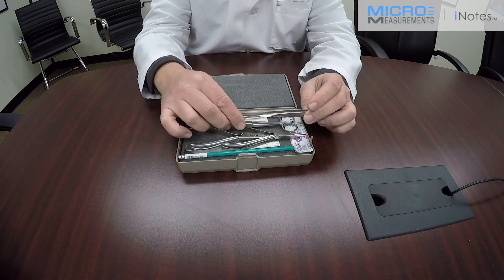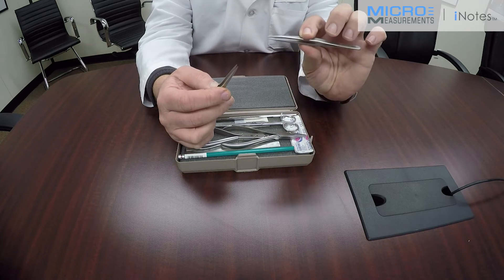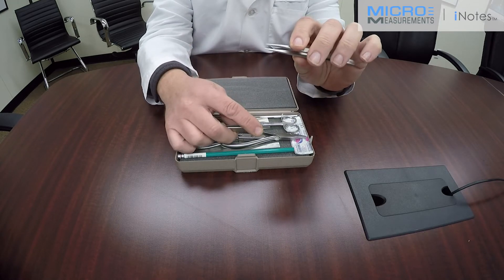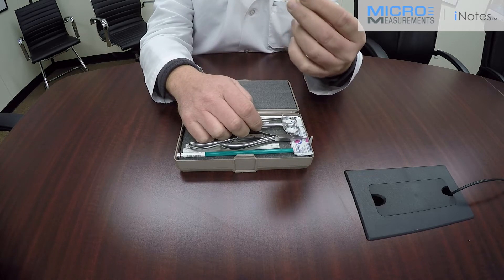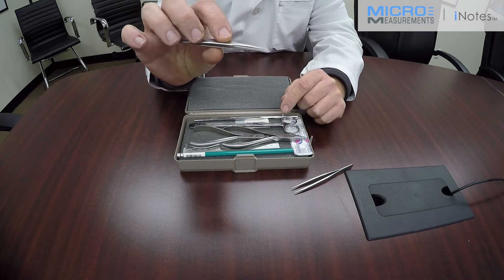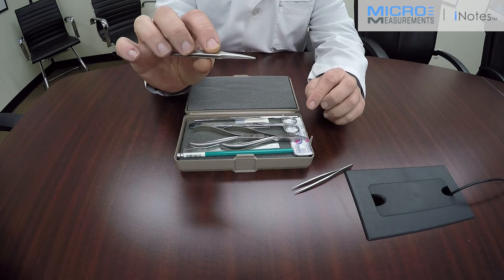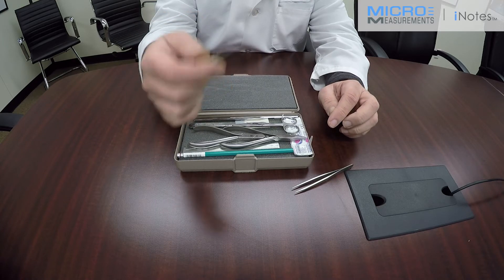These do not, and are made of materials that will last a very long time. Why are there two pairs of tweezers? When using the pointed tweezers, you want to use them to handle things that are dirty — for example, wires when you're soldering, or tape — because residues will get onto these tweezers. You should never handle a strain gauge with those, because you'll contaminate the installation. That's why the BTW-1 flat blunt tweezers are supplied specifically to handle strain gauges. Conversely, you would never use the BTW-1 for anything but strain gauges — always keep it clean and in pristine condition.